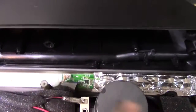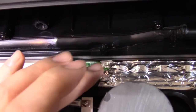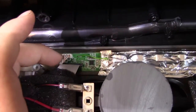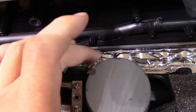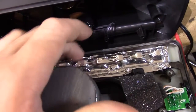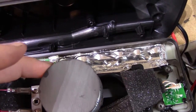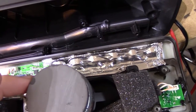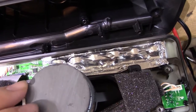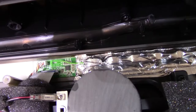but it responded very poorly. So what I did then was to just reflow all of these components, and also added this extra shielding strip that's connected to ground on the board there, because I'm not sure if there's any real shielding behind these buttons. It seemed to react a bit when I was poking around there. So I'm figuring it might be picking up more interference than it's designed to, in case of a cheap design made right on the edge with this touch controller.